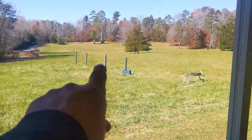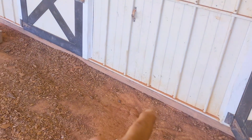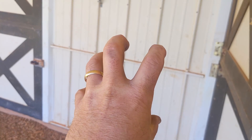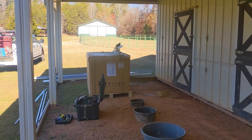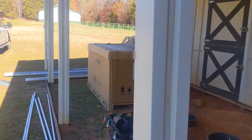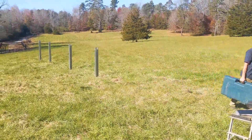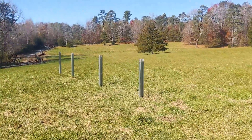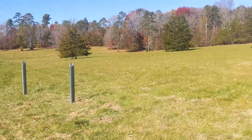We're going to come back and get that EMT through the horse stalls and out to the groundwork. We already pounded the posts in for the array — they went in really well today. We're going to bring some PVC up to a pull box, get into a one-inch LB, and start running. I think it's 11.2 kilowatts of Hanwha Q CELLS 400s — German engineering. We're switching over from pounding posts and we'll have a nice Sinclair ground mount fixed array at 35 degrees.